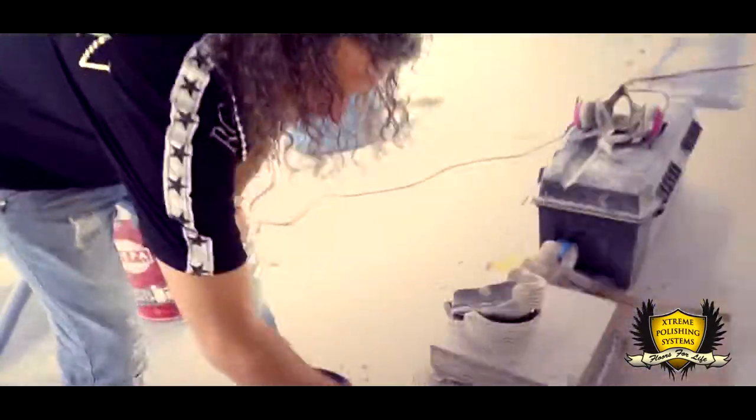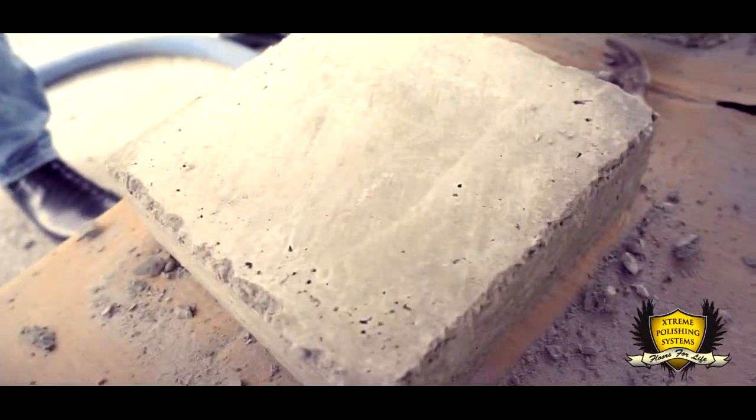All these little holes, okay? These are little capillary channels that form in the concrete. And then what we do is we fill that with our Rapid Set Skim Coat, or you can go with the product that we have from Metzger McGuire called Pit Grout, which is an epoxy type fill. So those are your two choices to fill up all your grout holes and do your grout preparation.